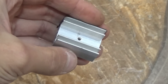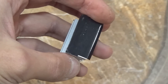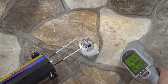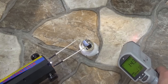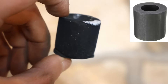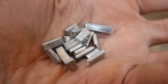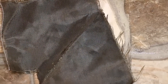You can't heat aluminum with such an induction heater, but we will still conduct the experiment. The black electrical tape on the workpiece is necessary for accurate temperature measurement. The metal heats up slightly, but that's the heat from the inductor. However, aluminum and other non-ferrous metals can not only be heated but also melted with such a heater — for this, you will need a graphite crucible. Throw pieces of aluminum inside, cover the crucible with something non-flammable. To retain heat, it's advisable to wrap the crucible with asbestos cloth; in my case, the crucible is wrapped with basalt fiber.